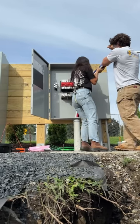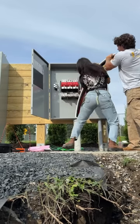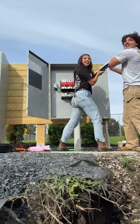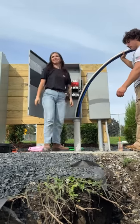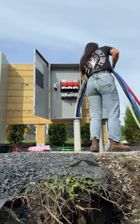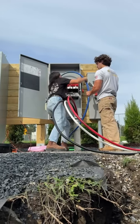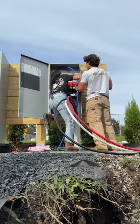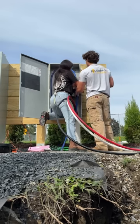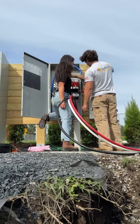Now Kyle and I are going to manhandle this wire. This run really wasn't far so it wasn't a tough 600 MCM pull. You can see the ground is dug up in front of me — that's kind of where the transformer is, maybe about five feet back. Now we're going to wrestle this wire in and I'm going to show you the whole thing because it is really a pain in the ass to bend this type of wire in this small enclosure.